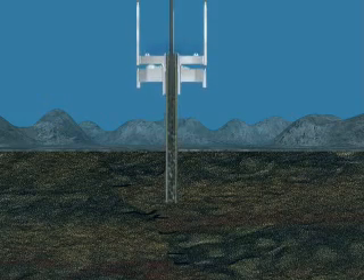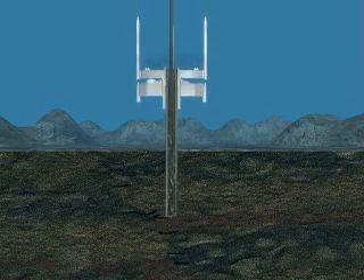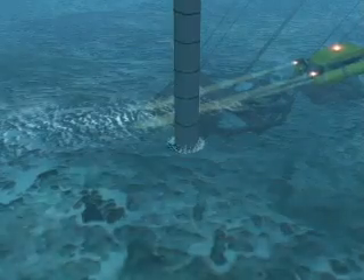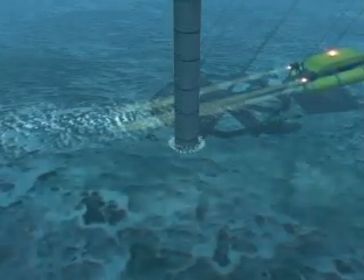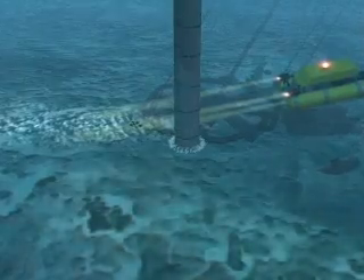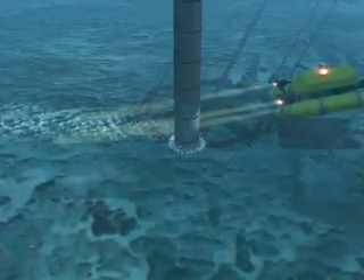The circulation stream exits the top of the casing and is dispersed into the area around the well. It is critical to control pumping velocities and penetration rates so that the flow does not broach the casing shoe and flow up the outside of the casing. Since a jetted string of structural casing is supported solely by the friction of the seabed layers, the broaching of the casing shoe could result in a less stable foundation.